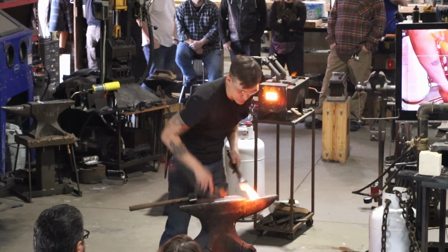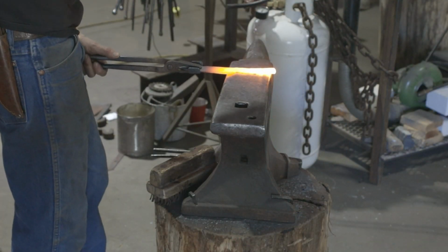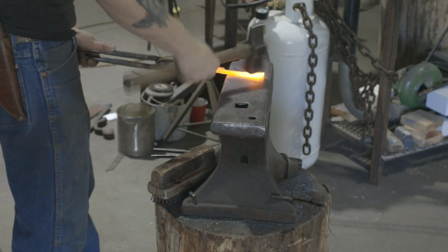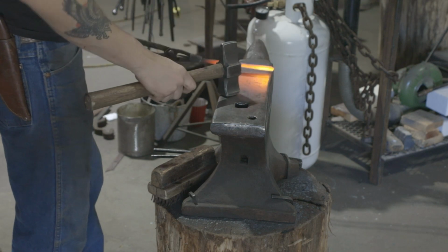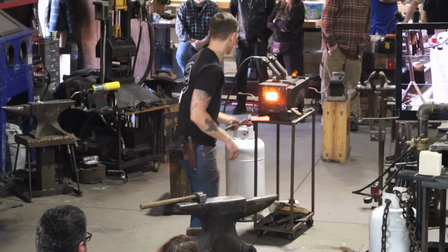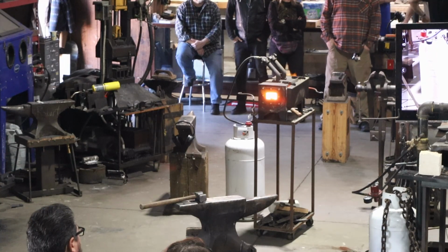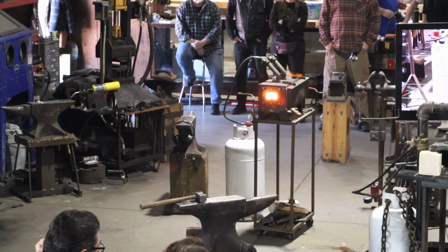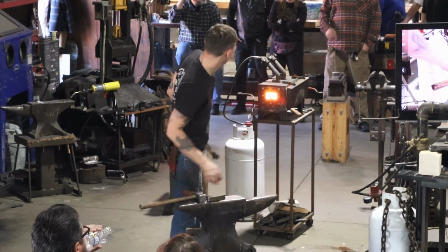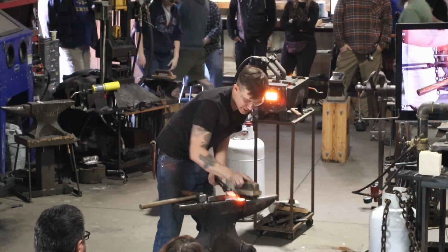But I want to see, when people are forging, that hammer come up. So if you have to slow down, that's more work than this, generally. It also does depend on the part of the process, because with planishing, I want to get a lightweight hammer. It's too light. Something like this and just kind of play whack-a-mole. Make the low places high and the high places low.